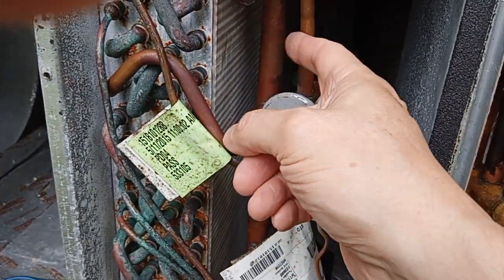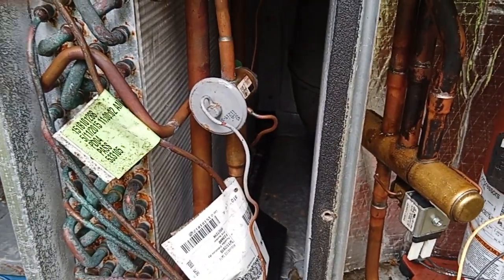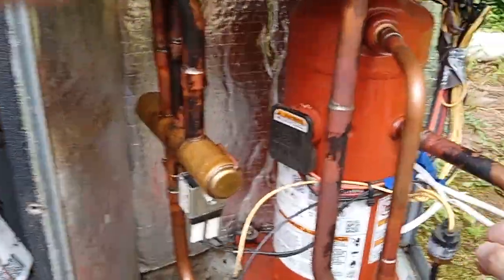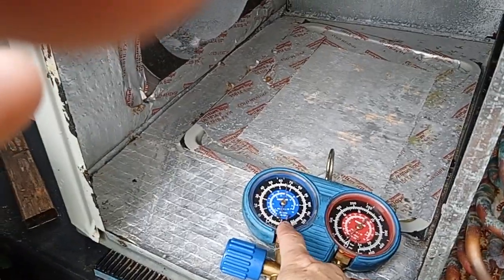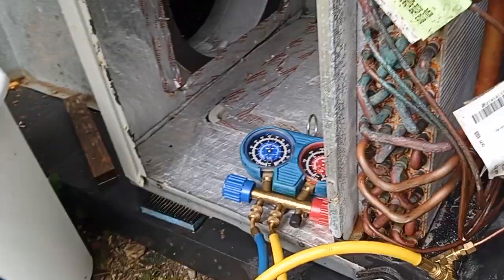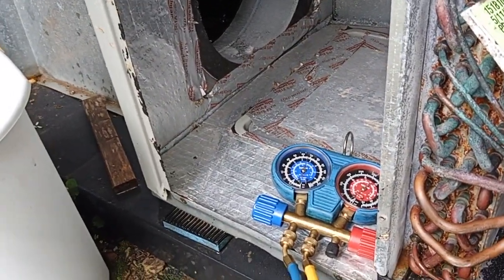In the old days we would sense the state of charge by seeing how far across the evaporator was cold or frosted. I did not measure the low side when I connected the can. With compressed air it was at 140 psi at the top of the gauge; when I connected it, it went down to 67 because this long line was empty, so I lost a great deal of the pressure — and that little R134 can doesn't hold much air.